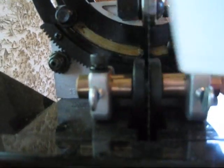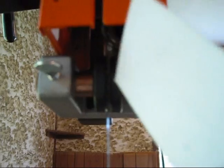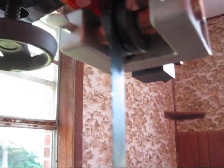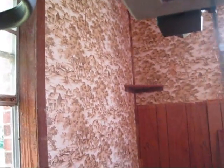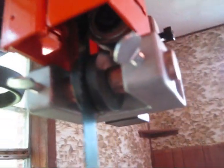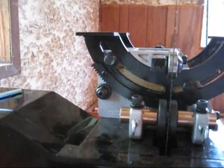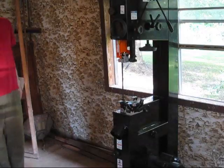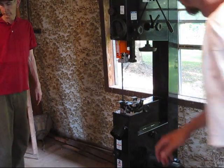And the same is true from this side, and the same for this bearing right here, and the same for the top set of guides. For all of that, you just stick the business card in there and make sure it's good and tight. And the back bearing up here, because that's where another guide is. So once you do all that, that's all your major settings for your guide system. Alright, we're going to put the table on now.